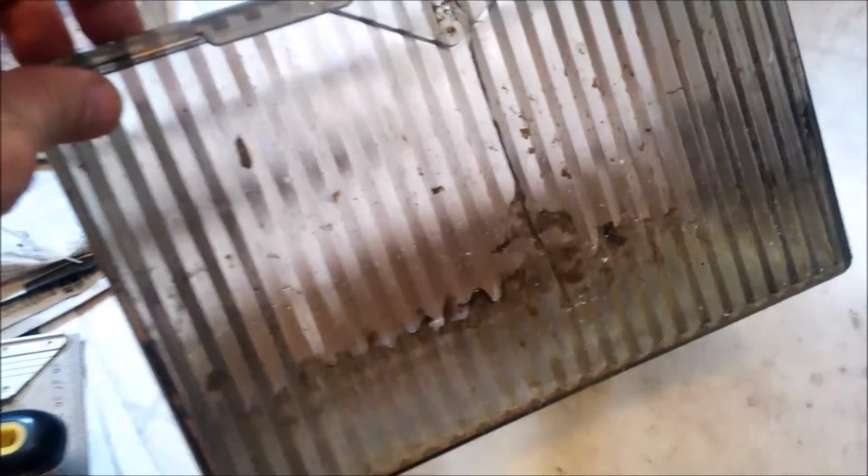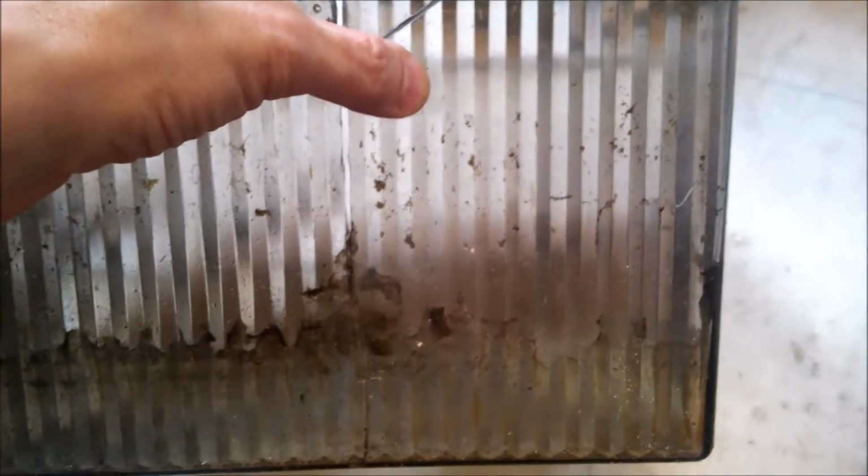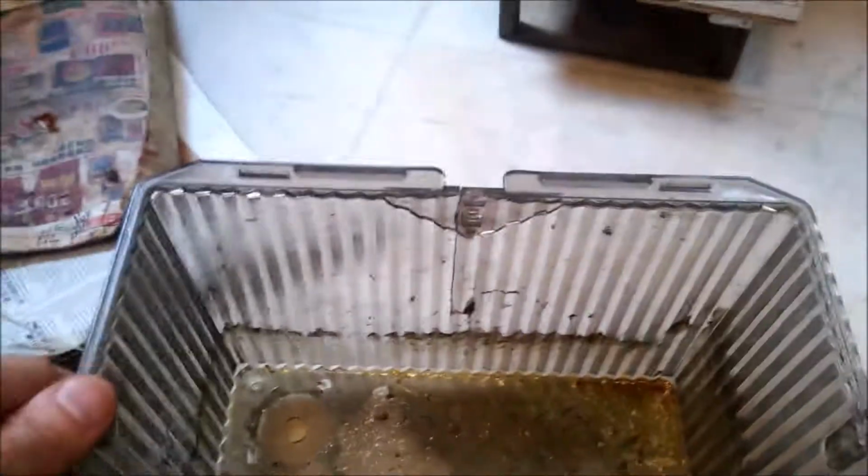And one thing is that in the old days I used this container. This is scrapped pieces. I got it without any money. It's a camera storage box, and I used it for 2 or 3 years. But this is a hard material. I think it's PC material, and I used it, and I also learned that it will crack since the oil-based solution will attack PC material. So after using it for some time, it cracks around here. So remember, don't use PC material. And this is polypropylene, and it's much better.